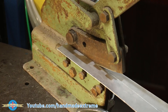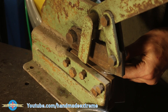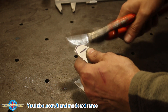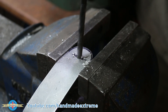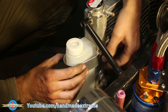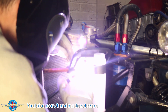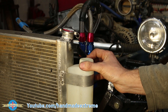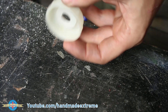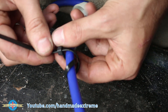For the strap that's going to go around the top of the bottle I used a bit of one-millimetre aluminium so it's nice and flexible. I cut a radius on the end and gave it a file to make sure it hasn't got any sharp corners. I marked out and drilled a little hole so that it can connect to that little threaded boss on the back of the radiator. I then test fitted the bracket, put the screw in the back, pulled the bracket tight around the bottle, held it in place with a G-clamp, and then welded it into final position. If the expansion valve in the radiator cap opens, the water needs a way of getting into the bottle, so I drilled a big hole in the lid and put a piece of silicone hose in. I put a cable tie around the hose on the inside of the cap to make sure the hose can't be pulled or pushed out.